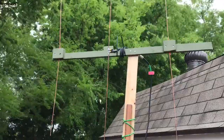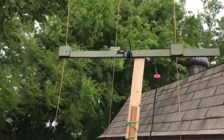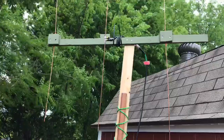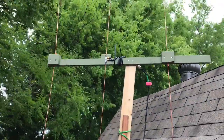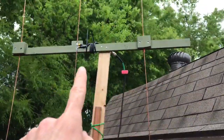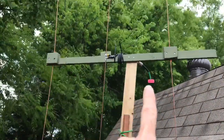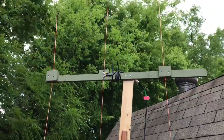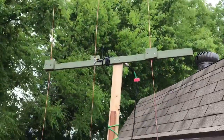I just had to cut down the driven element so it's shorter than it was designed at, and the reflector just a little bit, but otherwise it seems like a great antenna. The reason I like this design — this is kind of my implementation, you can probably come up with something better — is that it's reproducible. I can reproduce my SWR and performance when I'm out in the field. I want to be able to take this on mountains for SOTA activations, and that's the problem I've had with a lot of designs — they don't facilitate that.